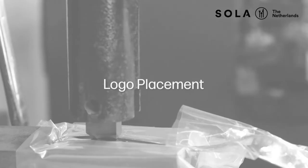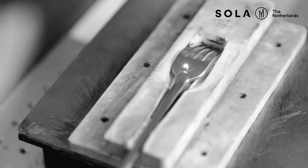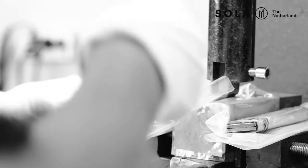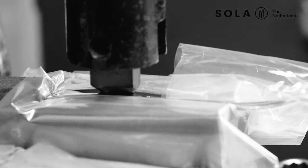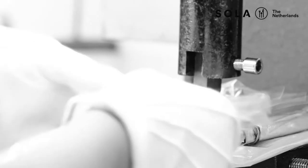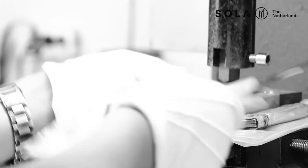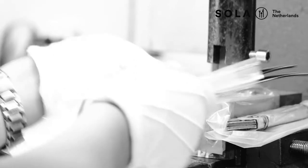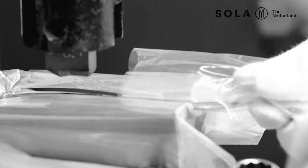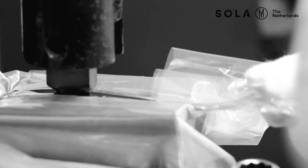Next is the logo placement. There are three types of logos available: stamped logo, etched logo, and laser logo. The stamped logo is the most commonly used — the logo is punched into the piece of cutlery on either the front or back using a logo die. The logo is carved into a block of steel as a mirror image and then pressed into the cutlery so the image appears readable. Alternatively, the toolmaker can have the logo made inside the mold so it is automatically placed during pressing. The advantage is no separate logo pressing step; the disadvantage is that if the logo needs to be changed, a new mold must be made. This procedure is used when volumes are large and no changes are foreseen in the near future.